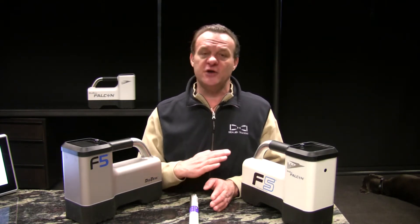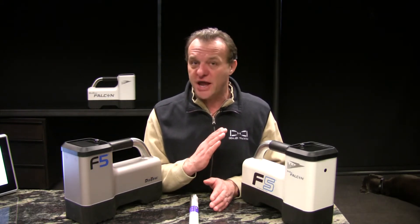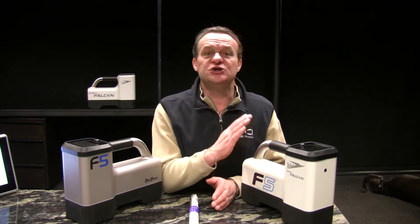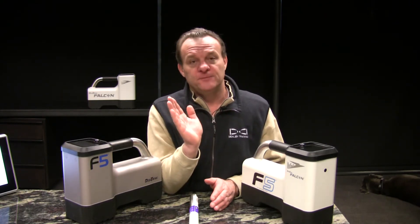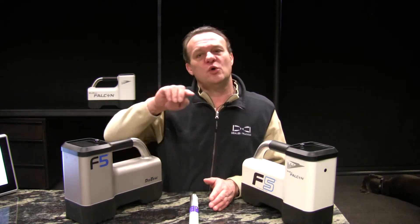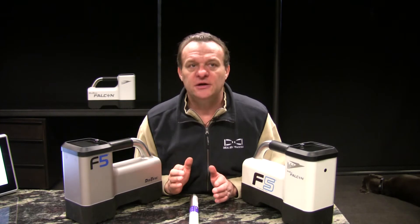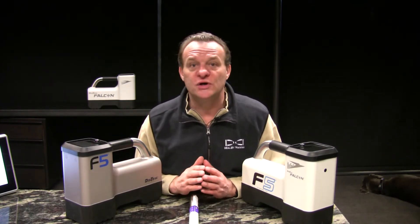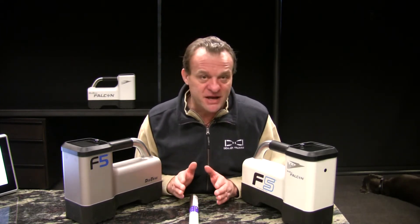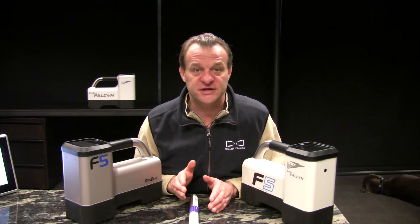You wait your 40 seconds and now you're going to slowly roll it clockwise to 10 o'clock and count 1001 up to 1013. Continue on clockwise to 2 o'clock and count once again up to 1013. Finally, rotate one last time down to 7 o'clock and count — about 10 to 15 seconds later, that transmitter will have shifted its mode or broadcasting frequency. Confirm that by looking at the receiver, and go into the receiver's menu to change it accordingly so it's set to pick up the correct frequency from the transmitter.